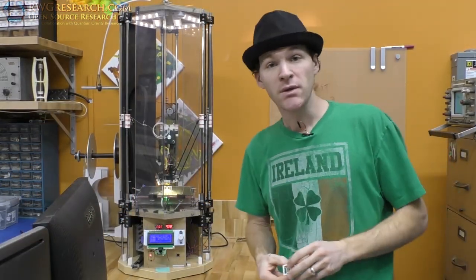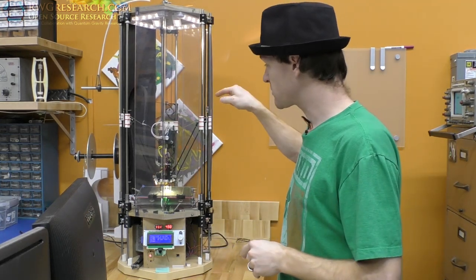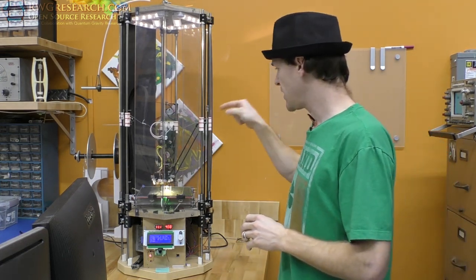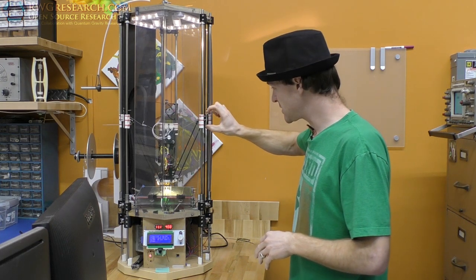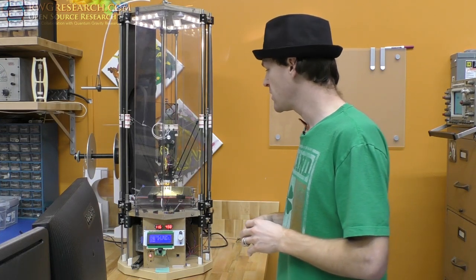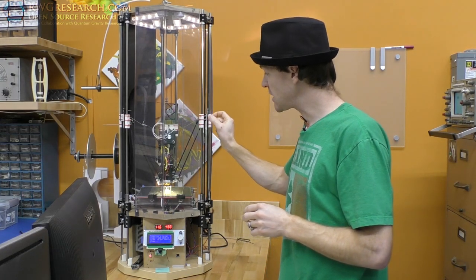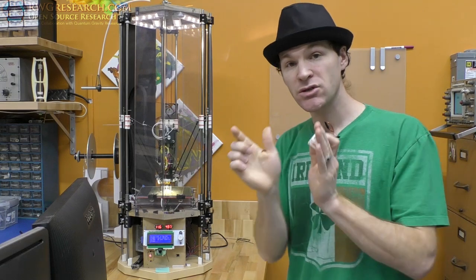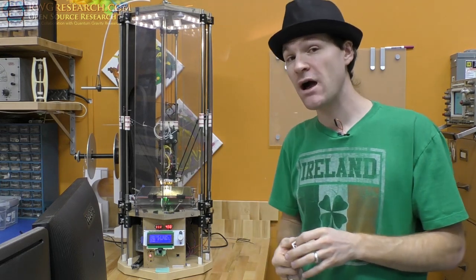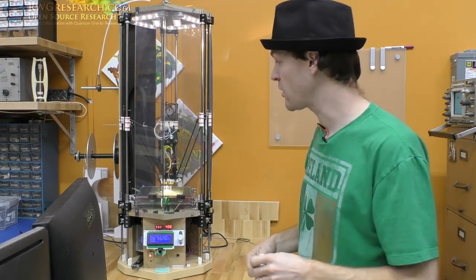All right, well, for the next revision of what I'm gonna do here is, as you saw in some of the footage, I've got some cracks on some of the pieces and how they connect, and I need to rework those. And these were printed on this printer, actually, but these sections right here were printed when the things had a lot of slop in them, and now they have a little bit of slop in them again. So I'm going to print these again as one solid piece, but this time on the bushing, I'm going to put a place where I can tighten and sort of make a clamp, and I can actually adjust how tight they are on here. Because right now, if I could adjust them, then I could just tighten them up, and we'd be on our way. They'd last for even a lot longer than a year.